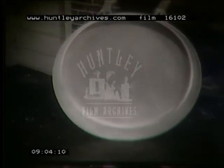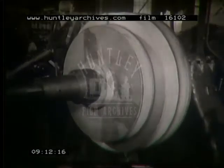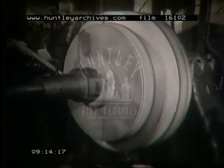Having thus seen the art of spinning in its simpler terms, let us look at some of its more involved aspects. Here is a shape that is too severe to form from a blank in one spinning operation. And this is how it's done. The original blank was broken down on 2 intermediate chucks.